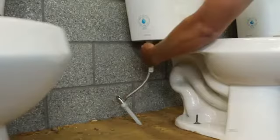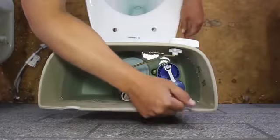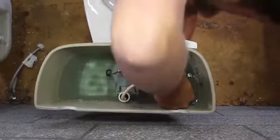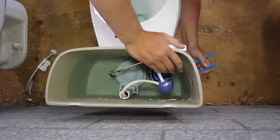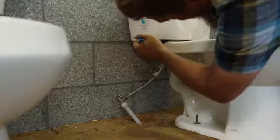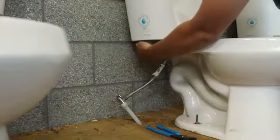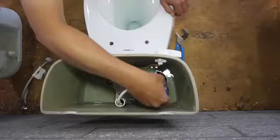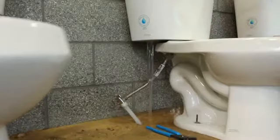I'm working here in the shop so I'm going to let it fall on the ground. I'm going to disconnect the top side of this supply valve — you may need a wrench for that, but this one is nice and loose. There's a nut right at the bottom of the fill valve. If you push down, sometimes you can get that to break loose. So then you reach in your back pocket and grab your wrench. You want to be really soft on these nuts because they are plastic. Remember: righty tighty lefty loosey to get this off.